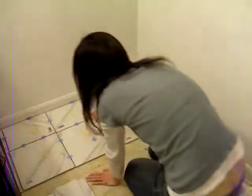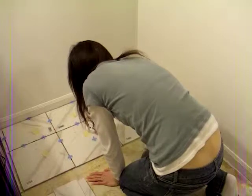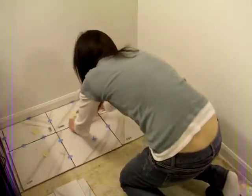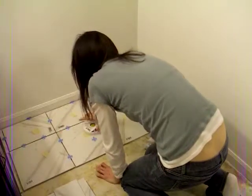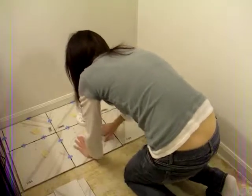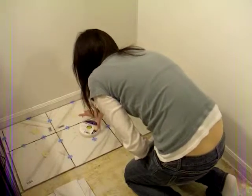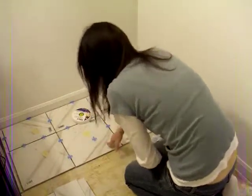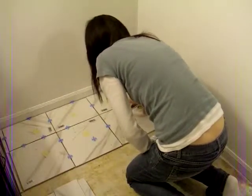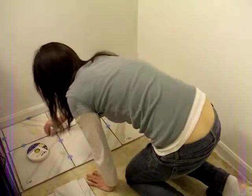Let's cut to the video and take a look — maybe it's not flat already. Oh, see that one? I heard that sound. Do it again — go back and forth quickly. You hear that? That tile against the wall is up in the air and I'm running in front of it. What happens when you put the mortar on it? It's going to be big. See, that wasn't too bad. But that's what you're going to do once you start setting the tiles.